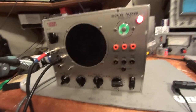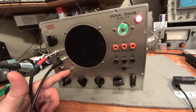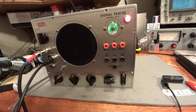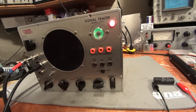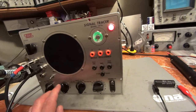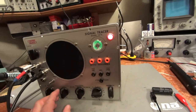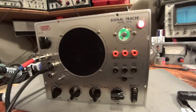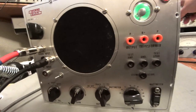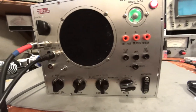For this demonstration this is set to noise and the toggle switch is set over, and the reason is so that we won't fry the Carlson Super Probe. To go back to the super probe, all we have to do is click that switch over to the left and put this back to audio — and we're all set up for the Carlson probe. The Carlson probe is functioning; you can hear it listening to my modem. That's how that double-pole double-throw switch works.